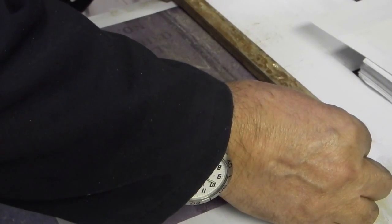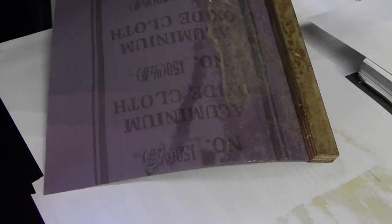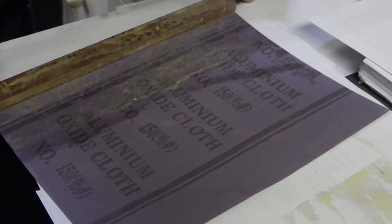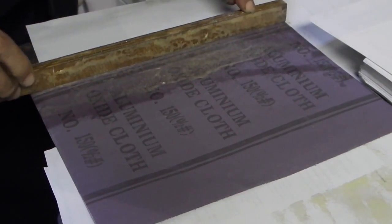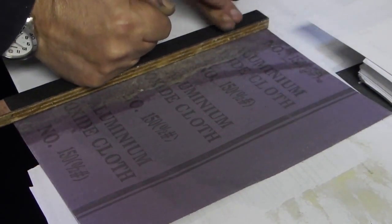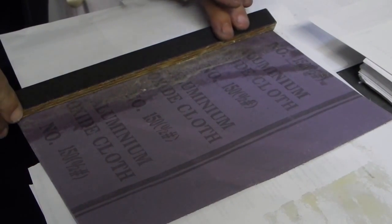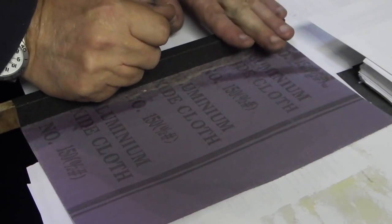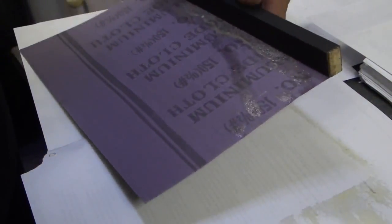Once both sides are ready to glue, take the stick, place it along the edge of your emery cloth and push it firmly down. Smooth it out all the way along, then place it on a flat surface and rotate the stick 90 degrees on top of the emery cloth to get the next face ready. Press this face down so that the emery sticks to the stick, fold it again and press it down again, and then fold it onto the last side and press that down until all the sides are firmly pressed and stuck to the emery stick.